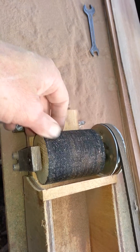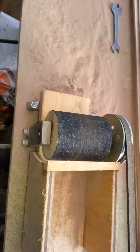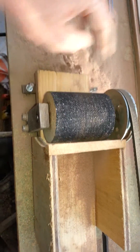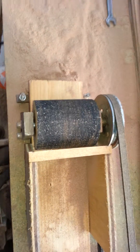So basically I've got a round piece of sandpaper spinning — I think it's a 1420 motor, so 2800 RPM, and it's about 2.5 inches diameter. Push your wood in one side and out the other side, and I'll run it up and show you.